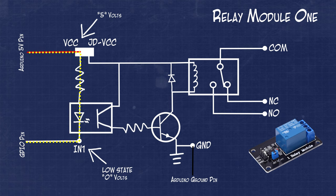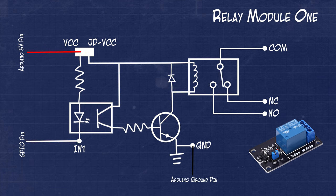Speaking about the optocoupler, when current is passed through the LED inside the device, it will activate a phototransistor. That phototransistor will in turn activate the main transistor, allowing current to flow from the VCC/JDVCC rail to ground. This will also activate the relay, causing the switch inside of it to flip from normally closed to normally open. In this configuration, we have a small issue to be aware of. Since we're connecting VCC with JDVCC, if something were to happen to the electrical circuit on the relay module, there is the potential for the issue to feed back into our microcontroller. So even though we're driving the input through an optocoupler, a path back to our micro exists via the 5V rail.